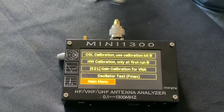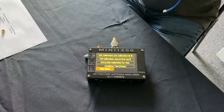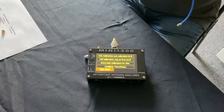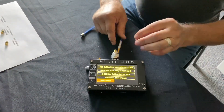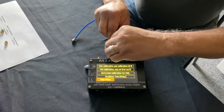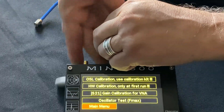The S21 calibration is where we transmit from here and measure here. For that, we're going to be using just any piece of coaxial cable that you happen to use. It's useful if you've got a long run to be able to calibrate at the end of your cable, rather than at the VNA itself. But for now, we're just getting this thing calibrated for first use.